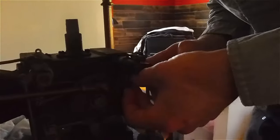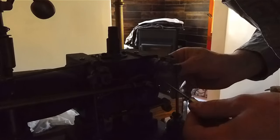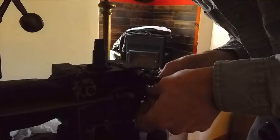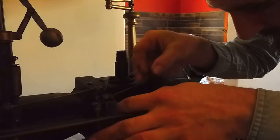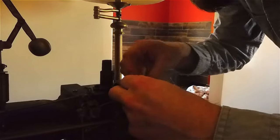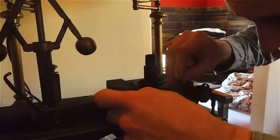Look at that — this is much better. That's a much better control angle for that. So this needs to go back up the way it came. Because otherwise, with some of these Corliss engines, you'll actually drop some of the latch parts out if you do it wrong. So the rod should be the other way — the rod is upside down in how it's bent.